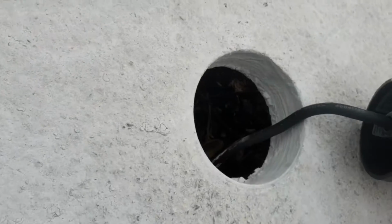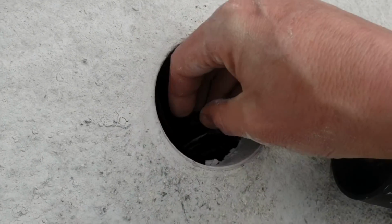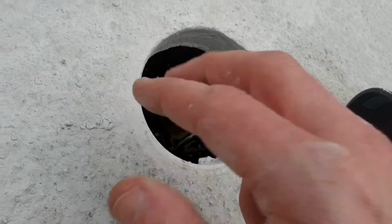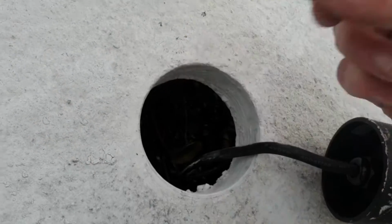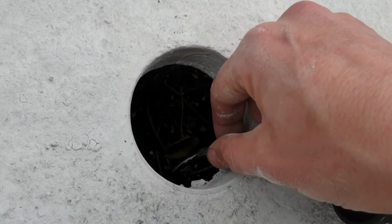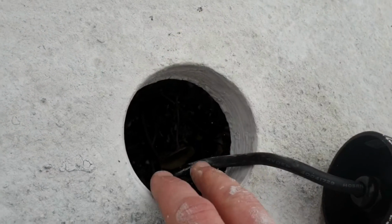The other thing to bear in mind, this goes back to what I just said a moment ago, is my hands can fit in this, so you can do some work, but splicing or joining any cables is going to be really tricky. So it's really important that the cable you're presenting out of the ground, you've got enough flex in it that you can join the two together, because if you don't do that, you're going to be really struggling to do the delicate work around there in terms of how that comes together.